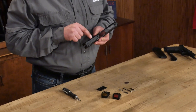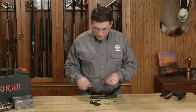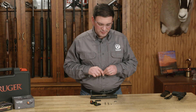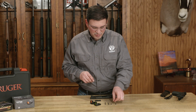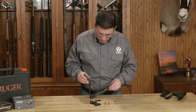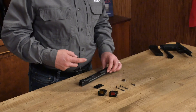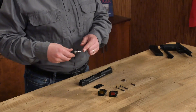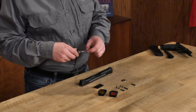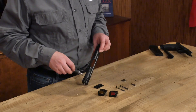To mount that plate, you first need to remove the two filler screws in the top of the slide. Always use the correct size bits — if you have any questions, all of these are listed in the manual. These screws have a little bit of thread locking compound on them to make sure they stay put. They're very small, so put them aside and don't lose them.